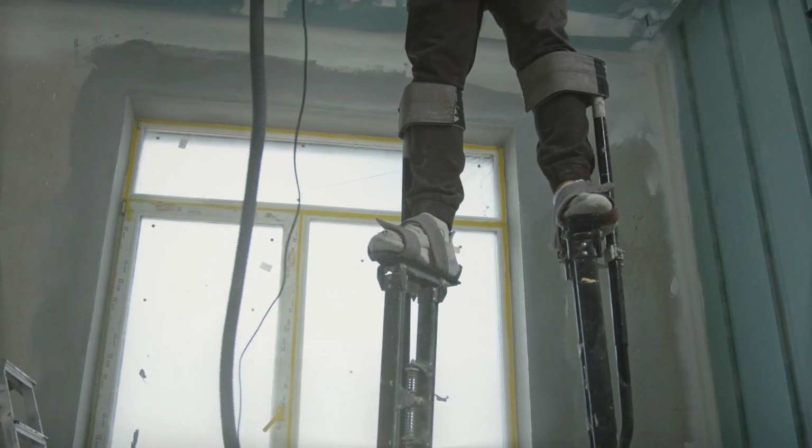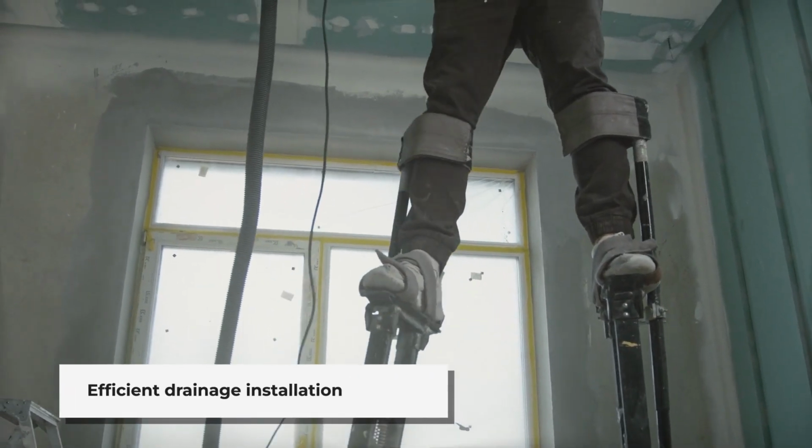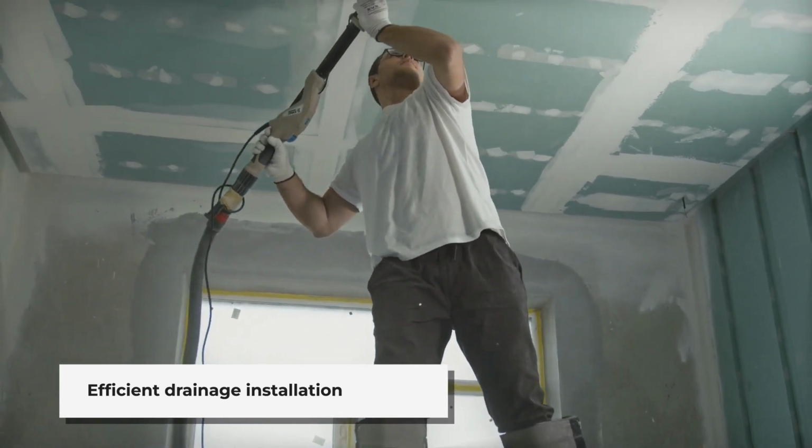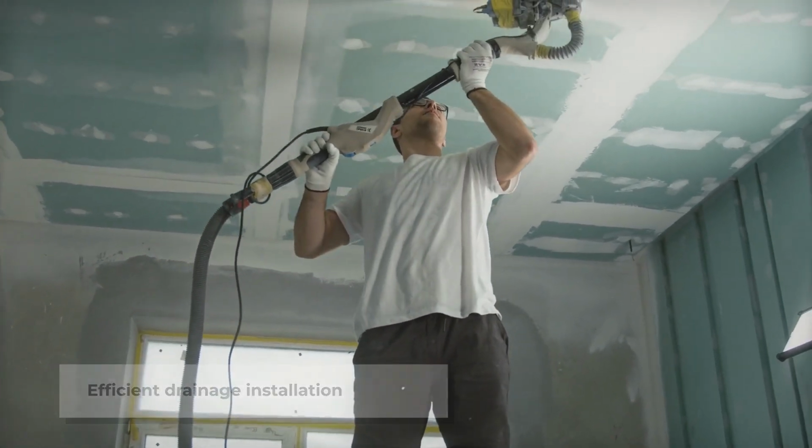The trench went deep to shallow with a natural slope along the wall, so we didn't have any problems laying the pipe for drainage. Next came a few more inches of gravel that covered the pipe, then we backfilled.